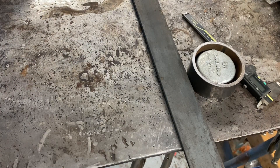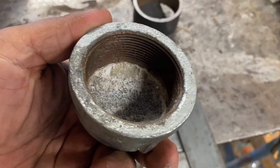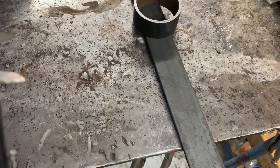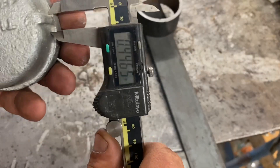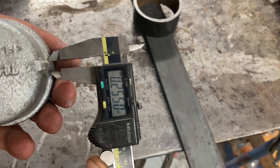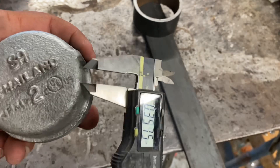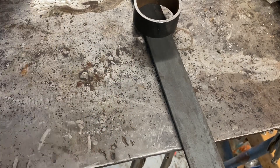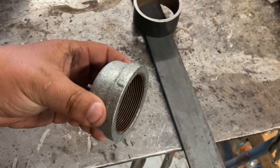For the holes and stuff we drill, we don't have to be super within a thou or whatever because these caps — this one's made in Thailand but it's the same one for everyone I've ever run across. They're cast first of all, and then they're very thickly coated with galvanization. So you know, right down as close as I can get it — two hundred and fifty-five thou on one side. The other side, as close as I can get it with how thick the coating is — two hundred seventy-nine. There's no measurement on this thing that is not probably twenty-five to thirty thou off. So as long as it traps it and one of those bolts is hitting an ear, that'll be enough because they're going to vary — they are cast and then hot dipped.